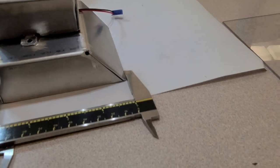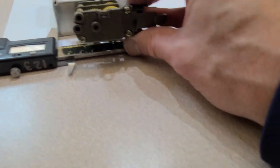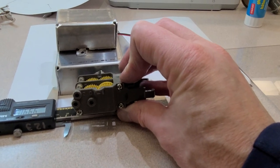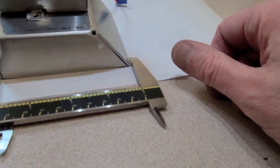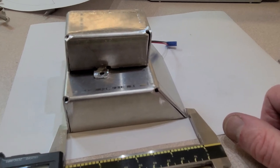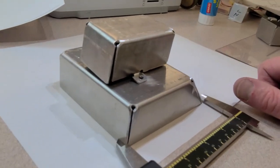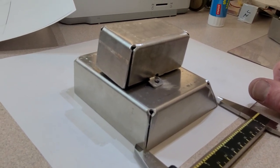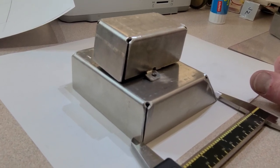Next is our spacer block that's going to go in the middle to separate the gearbox out, because right now the gearbox wouldn't be sitting low enough. That'll set the gearbox down a little bit, and that spacer block will add some weight, because even with the batteries in there now, we're still well under 500 grams. We still got to put wheels on it and a coat of paint and a few things on there, but when it comes to quickly folding up a simple sheet metal mini sumo robot, there's some tips to get you started. Okay. Looking forward to seeing your designs.